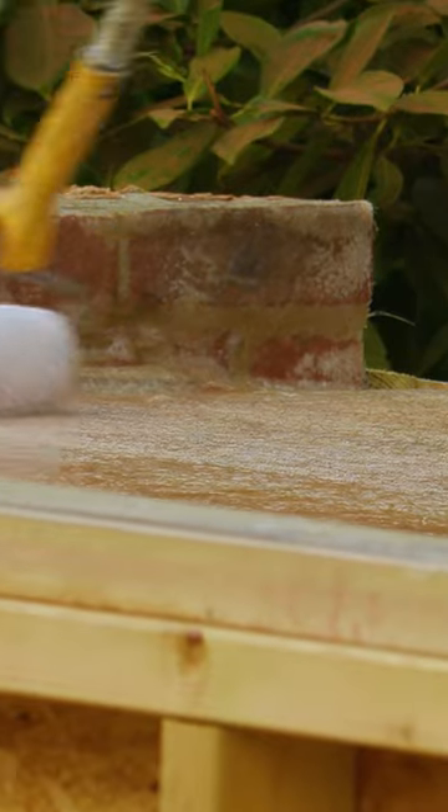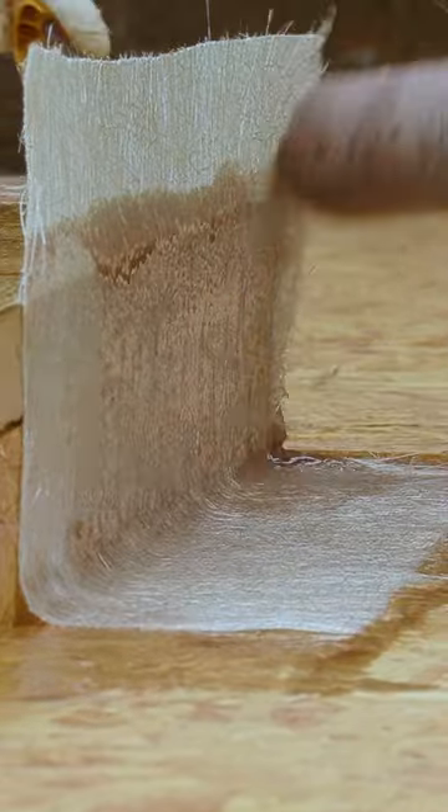There are a lot of people who think they'd rather use plywood than OSB. In actual fact, the GRP flat roof manufacturers say to use OSB3 — don't use plywood, as it can delaminate. So you've got all that lovely GRP roofing sitting on one very thin layer of plywood which is separated from the rest of it.